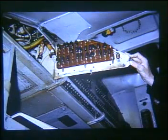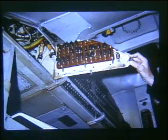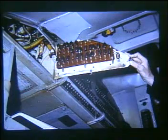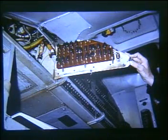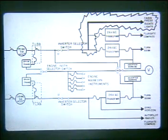The fuses are mounted in rubber blocks with a spare fuse. The AC fuse panel contains fuses for the captain's, first officer's, and engine instruments, and for AC radio feeds, pressurization, and some miscellaneous AC requirements. Prior to the 26 volt AC step-down transformer, 115 volt AC is taken off to supply power to the automatic section of the cabin pressure control system, certain radio equipment in the radio rack area, and fluorescent lights in the blue room. Fuses to protect the cabin pressurization and lighting system are located in the AC fuse panel.